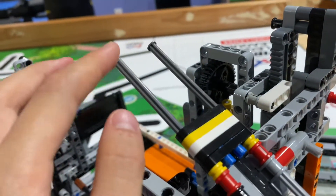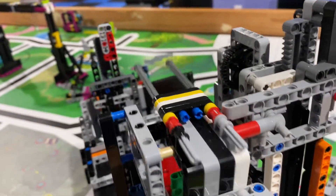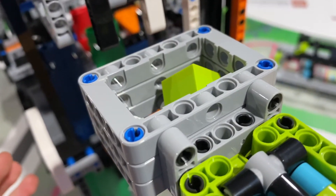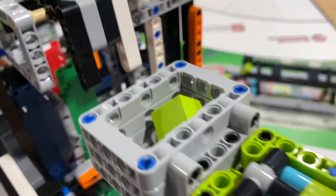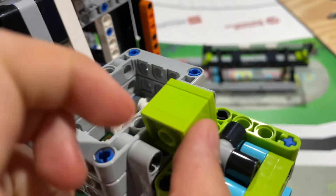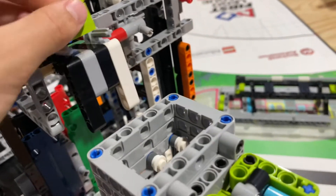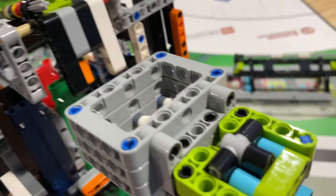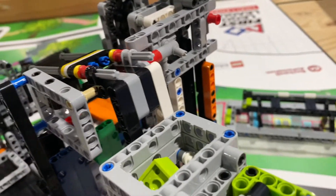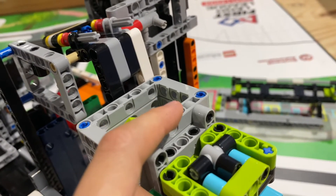I have weights in the back — I used trial and error to make sure the weight was balanced so that the cube doesn't fall out while traveling. It's quite a simple mechanism. The only risk is if the cube comes out one of the sides or the back, but that's the same for almost every mechanism. This one has slightly more risk because it's a slope — if the angle or speed isn't right, the momentum can occasionally propel it just enough to reach the outside of the rim.